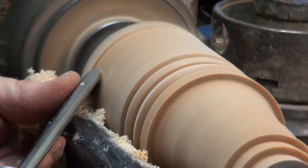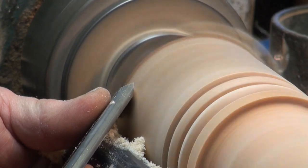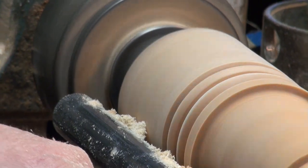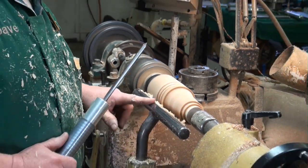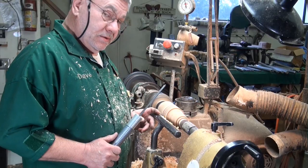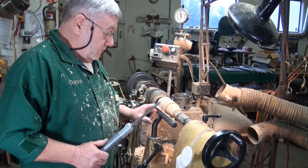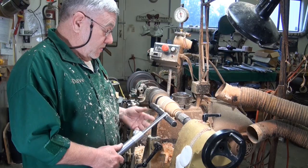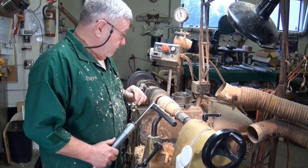You can see how my thumb is holding the tool down on the tool rest and I have my finger hooked underneath the tool rest. I have little short stubby hands, that's why I kind of use these round tool rests. There are advantages and disadvantages to the round tool rest. The disadvantage is you can't get it really close. The advantage for me is I use my finger under it a lot. When I have a lot of material I can't get my thumb under there, and I use my thumb as an anchor. That's strictly my preference.